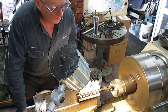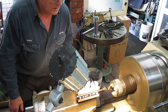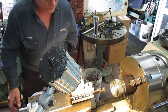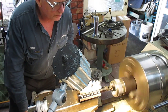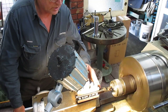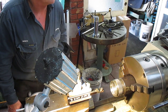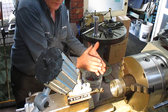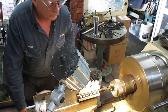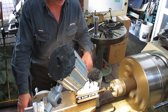I'll just run the tool in, and when I get through, I'll run it out again. It's set on the DRO so I could come in, mark the next cut and do the same thing again. Just come through, finish the cut and out again. And always come back a fair bit — especially with these large threads. With large threads you want a bit of time for the lead screw and everything to take up and not be too close, because otherwise it might jump through. Just cut through the cut, spit her out and come back out. And worked away till I got the thread completed.